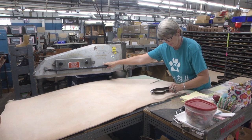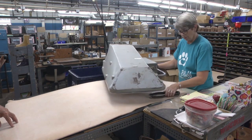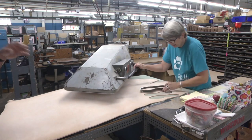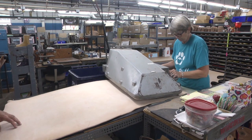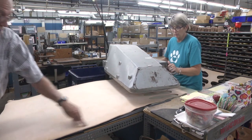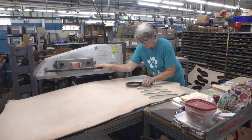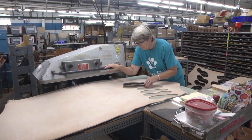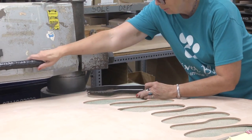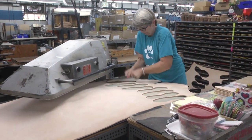Barb's cutting out of a leather bend. Leather bends are used for outsoles, and different from the upper leather, outsole leather is vegetable tan. Upper leather is chrome tan. She's going to die-cut out the leather soles, and then we'll split it to thickness and rough it so we can cement it. Again, like the upper leather, you've got the belly down here, the back line up here, the butt here, and the neck up in that area. You can see her placing the die as close together as she can. This bend is pretty clean but you can get some real big brands in it too, and some imperfections, to work around.